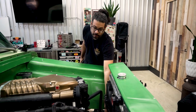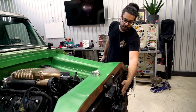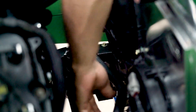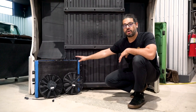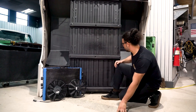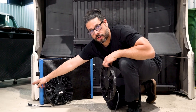Now moving on to the outlet from the pump to the heat exchanger. Normally it would sit right behind the grill, but for our application we're doing something different. We ran out of space with all the fans, AC condenser, and cooling pump in the engine bay, so we decided to mount our heat exchanger system in the bed of the truck. Tim fabbed up brackets that mount to the factory mounting locations on the heat exchanger — hot water comes in on one side and exits cooler on the other. In the next episode we're going to be doing some exterior wiring as well as getting this mounted and plumbed up.